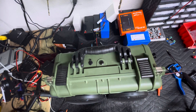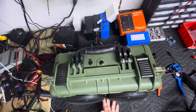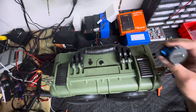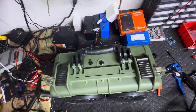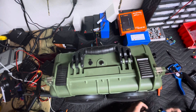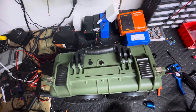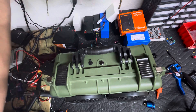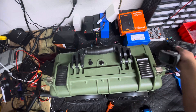There's a little groundwork you got to do. You got to figure out where you want it. If this box is going to be floating down a river, you wouldn't put your switch or your DC plug on the side right here — you would put it on a front face and probably towards the bottom. But since this is not a floating one, I'm going to put this right here, just above the latch. Grab the drill and we will install this in no time.